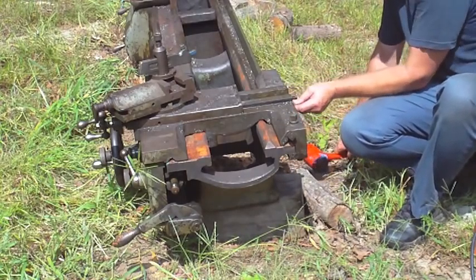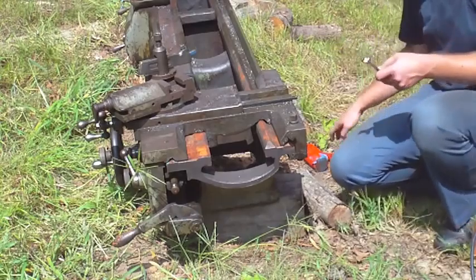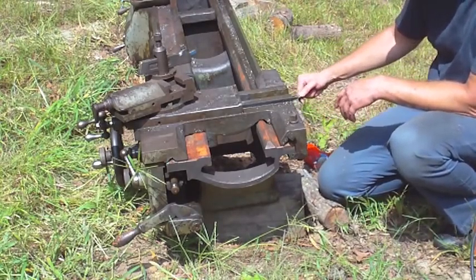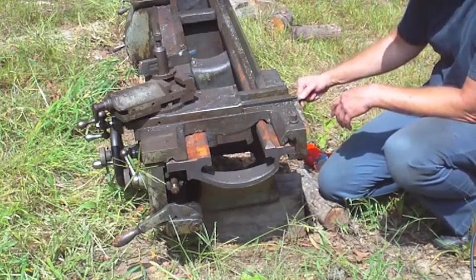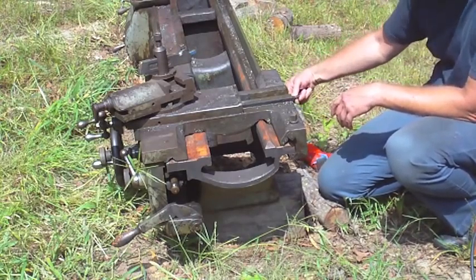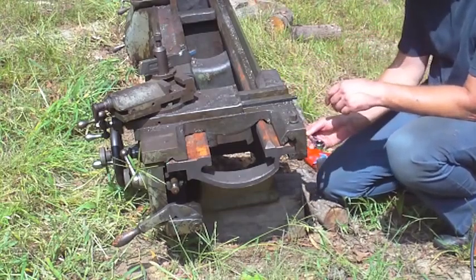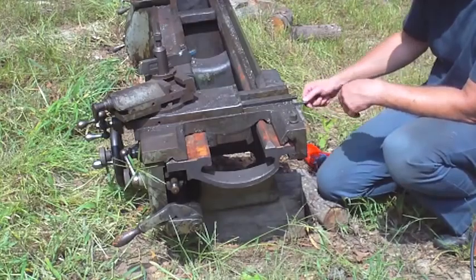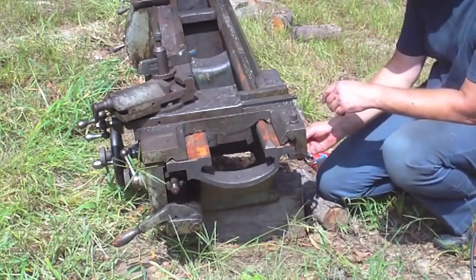No more runaway problems. The linkage is still sloppy, but I've got to adjust it to a point where I can pretty consistently pop it into neutral without it wanting to pop back into reverse after going forward, which is the big problem I was having before — you'd think you're putting it back into neutral and the thing would go into reverse, which is a pain.